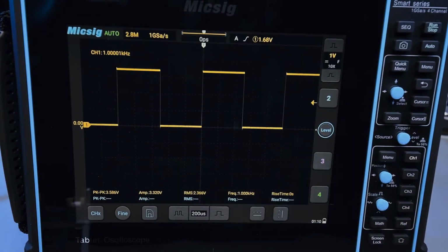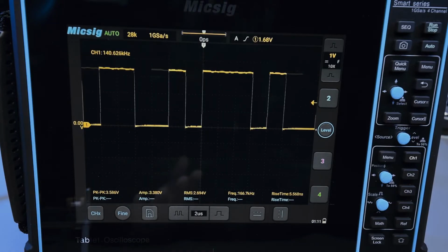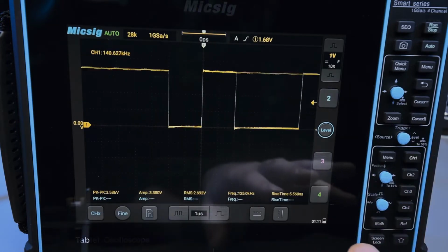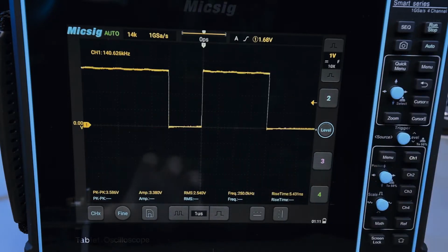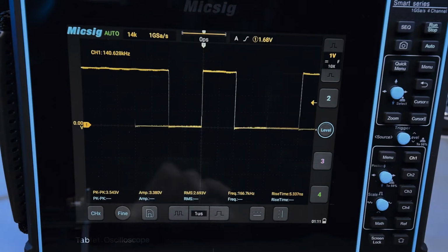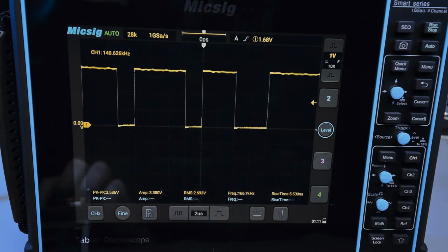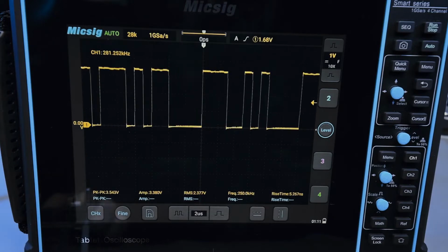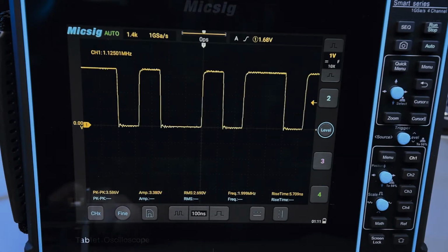Okay, so it's been a hot minute, and I had lunch, and I can now show you another feature. So we're back to the same 1 kilohertz square wave, and now if I press one button, we get data. And it actually auto-scales it correctly, because the auto mode is still on, and that's really cool. So I have 4 speeds for UART programmed into my little FPGA board. This is 500 kilobits per second. This is 1 megabit. This is 4 megabit. Auto scales, and this is 8 megabit.